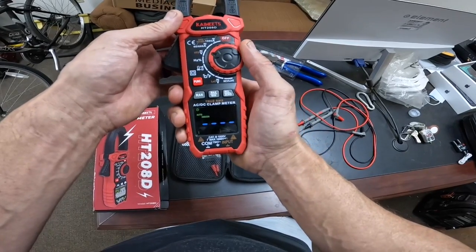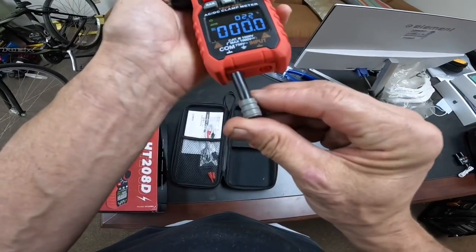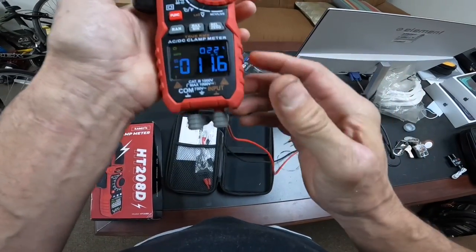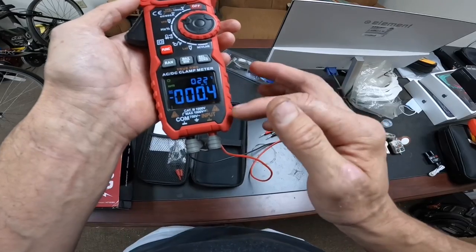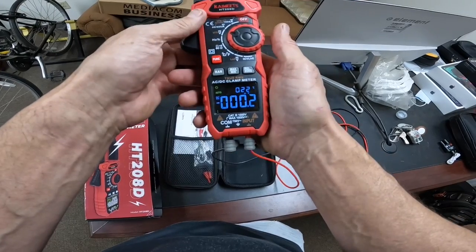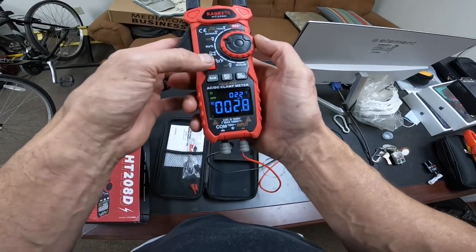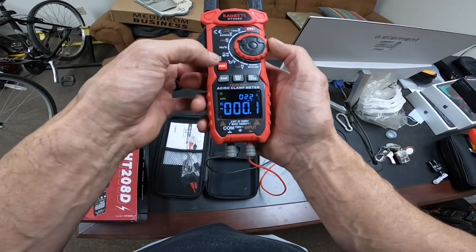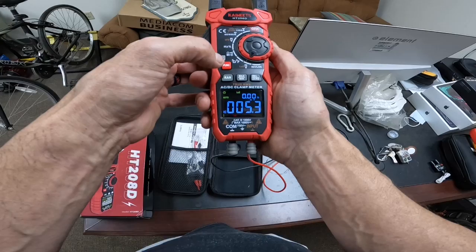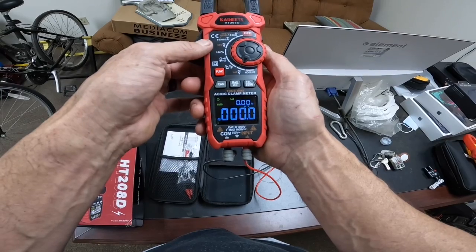I have found that when you switch to voltage, it's reading millivolts DC and it's auto ranging. When you plug up your lead, sometimes it's reading some ghost voltage. I have actually seen where that can read up to like a hundred millivolts, just very temporarily. That can be a little awkward. But if you switch it to the Low Z right here, that ghost voltage basically goes away.